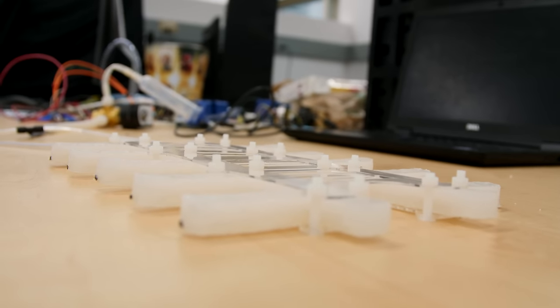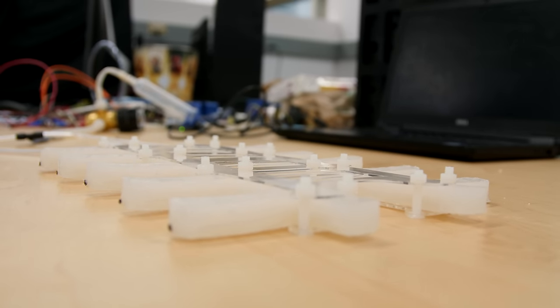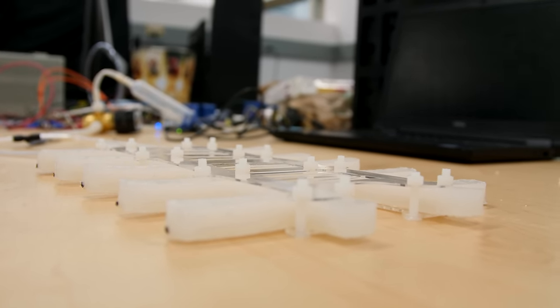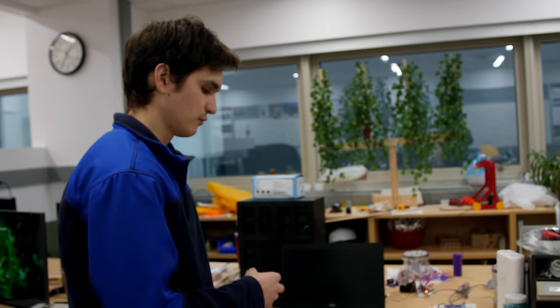This is all molded — not 3D printed. It has a good number of steps in the fabrication process. Basically it's several layers of ecoflex-type silicone molded around a foam. The foam gives a given porosity — about 50% open space for air to flow through it. That creates an amount of fluid resistance and causes a traveling wave through the robot. Right now the demo shows movement by inching forward via a traveling wave, but what we want to show mainly is that you can have a single inlet and then have a sequence of actuations enabled by the fluidic resistance from the foam inside the soft robot.